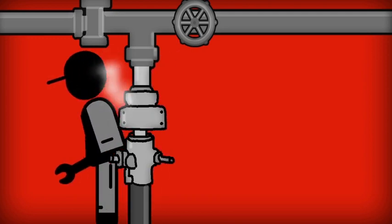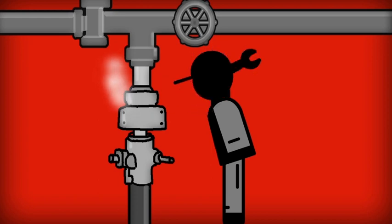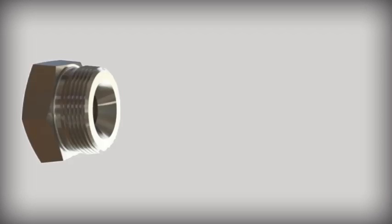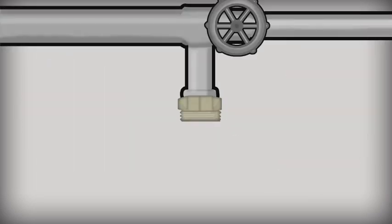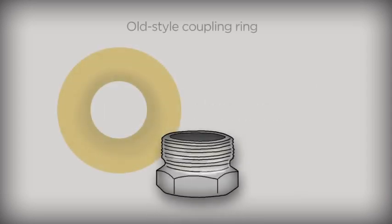That's about six thousand two hundred dollars in a typical steam season per coupling. Not only is hissing steam ridiculously wasteful, it's a bullseye target for every operator who walks by it with a tool in his hand — whack, bang — hit that nut, let's see if I can make that hissing stop. Steam couplings are pretty simple: they've all got a spud, hose stem, and swivel nut. The spud is attached to the pipe or manifold, and the hose stem is pressed into the spud when the swivel nut is tightened.